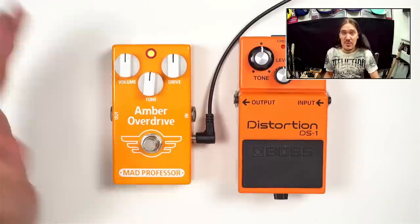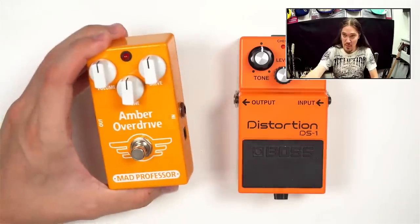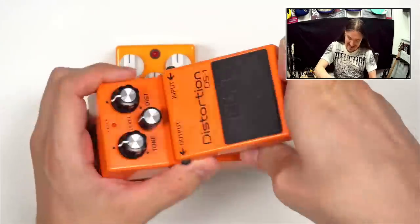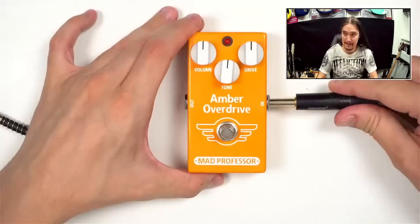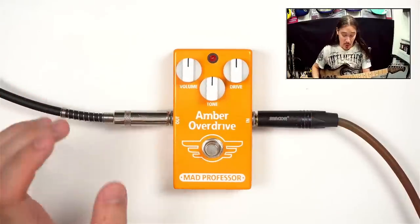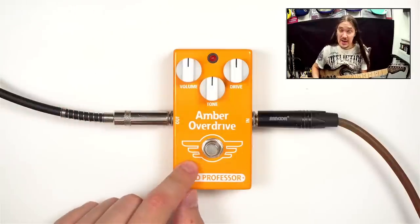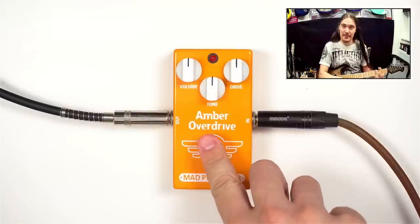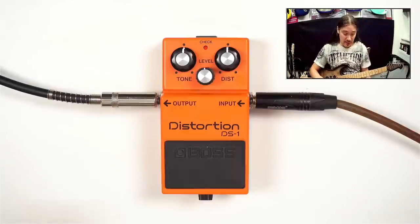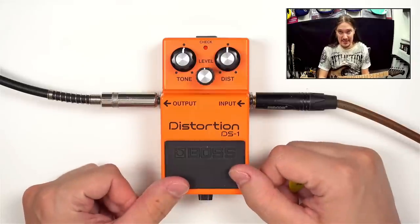This is a very easy test anyone can perform at home. All you need to do is make sure there is no power supply to the pedal — simply unplug the power cord or remove the battery if there is any. Now connect your guitar to the pedal and the pedal to the amp. Passive bypass doesn't require any power, which means even without a battery or power cord connected, a pedal with passive or true bypass when disengaged will let the signal through without any alteration. On the other side, if there is no sound coming out of your speaker no matter how many times you press the foot switch, you can definitely tell that the pedal has an active bypass.